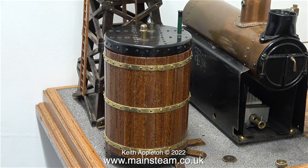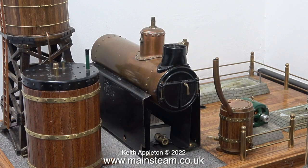Of course it is — how silly of me not to know that! This view shows the layout of the components on the board, and this very small tank to the right with the pipe sticking out of it, which is in front of the dynamo, is the condenser oil trap. Immediately I'm thinking that this condenser oil trap is far too small, but the larger tank used for housing the gas tank is perfect — unfortunately it's made from plastic, which is not really good. But maybe if I made a copper tank that fitted inside this plastic tank with plenty of thermal insulation it would be okay. That is something to think about much further on in the rebuild.